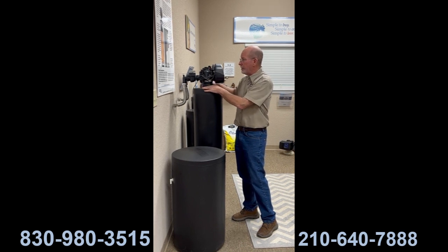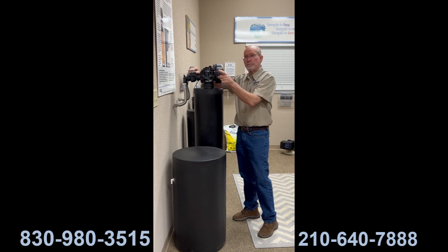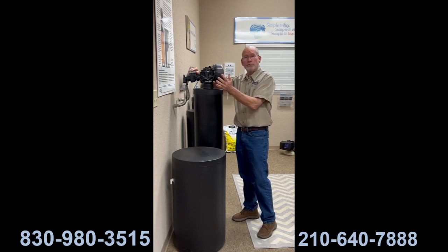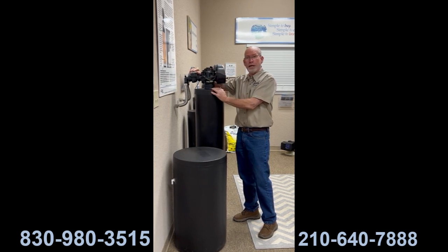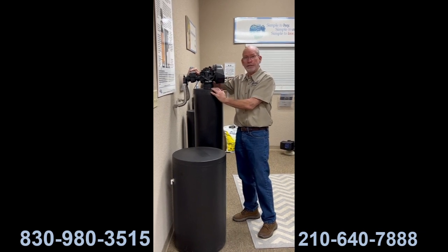So my recommendation is, don't put the unit in bypass. Just open a faucet inside the house and let it run just when you go to bed, and then you can turn it off in the morning because you'll be using water throughout the day. But don't put it in bypass, run a faucet inside. That's my best advice.